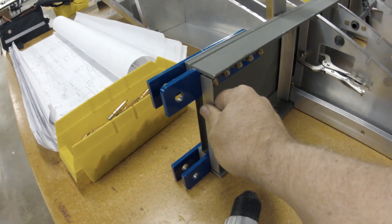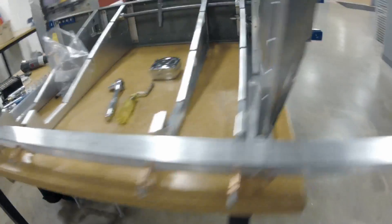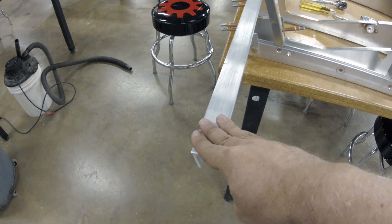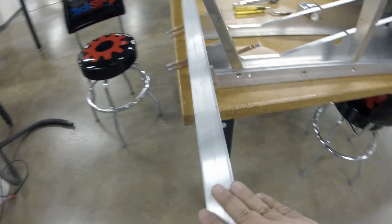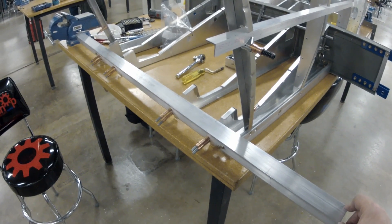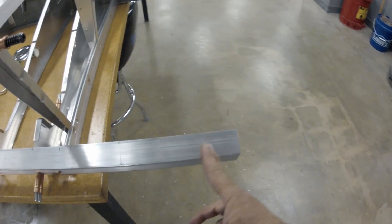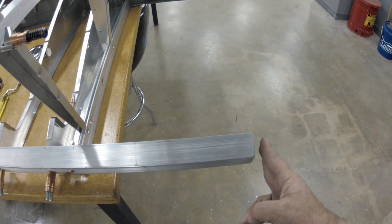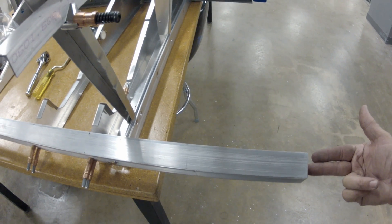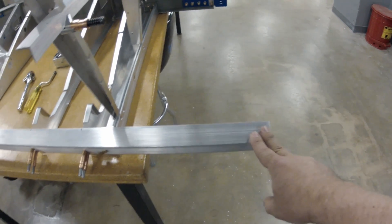The C1 intercostal is mounted and that is on the spar plans. Let's talk about the rear spar. It's just a piece of angle aluminum, 3/16th wall, one-and-a-half inch legs, but there are no dimensions given for how long it's supposed to be. I did some figuring and confirmed it with Mr. Thatcher — it is 50 and one-half inches long. That will bring the end right to the first rib of the wing, allowing the rear spar of the wing to come in, mate, and you can fit the bolts on there.